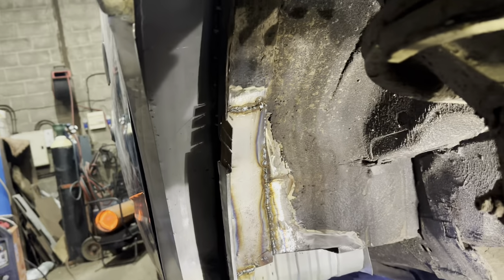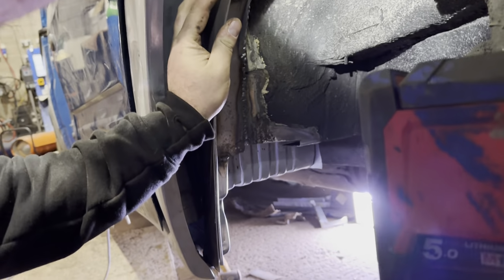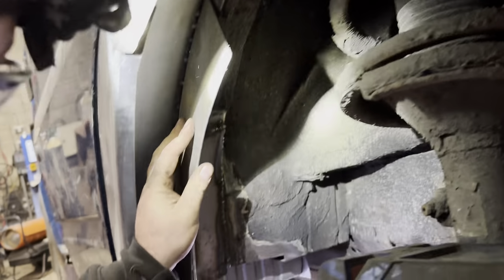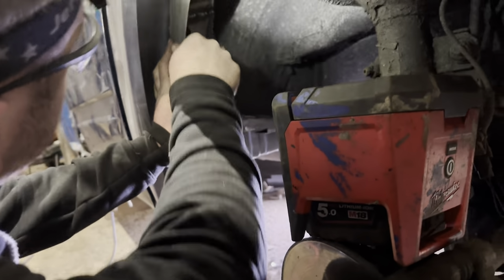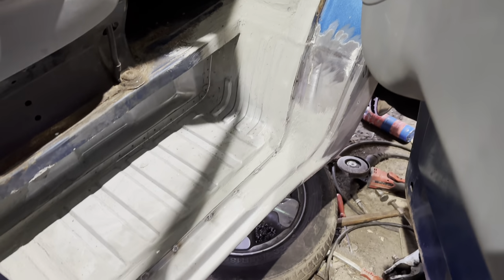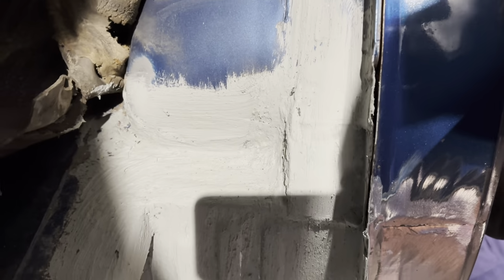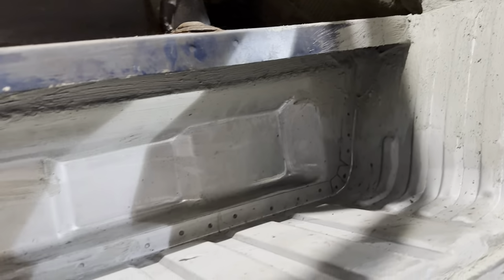And put that inner arch in, look. Look at that, like a new one. Oh, a bit up there to do. Lovely. Just needs a little bit of a clean off. And that bit's going to go in there. There's a bit to tack it down there, isn't there? Just needs a scalp. So that's that going in. This is all in now, seamed up. Like I say, we just like to run a bit of seam sealer around all the joints. Make it look nice.